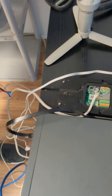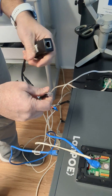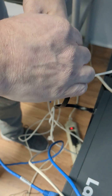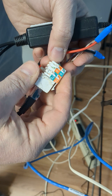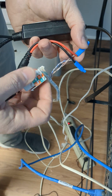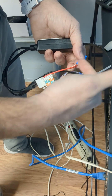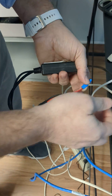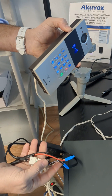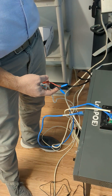If you don't want it to go on a regular adapter and you still want it to go through the PoE to be able to manage it, you get a 12-volt breakout — a 48-volt to 12-volt converter. The data goes in here. I just modified a jack over here. The green and the orange pairs are pins 1, 2, 3, 6. Then I took the brown and the blue pairs and connected them. For plus and minus, as long as you match your colors on both sides — I did plus as brown/brown-white and minus as blue/white-blue. The device is getting powered over PoE but it's actually being converted to 12 volts, so I don't need to worry about using a managed switch to power cycle it.